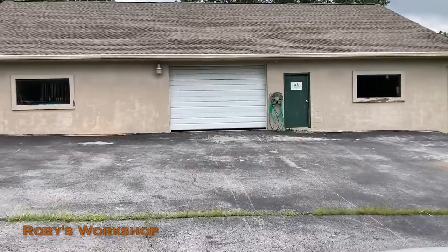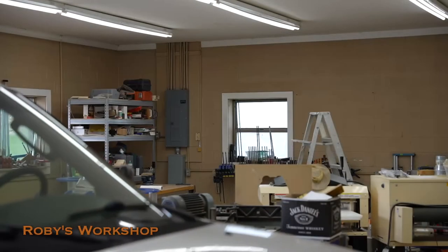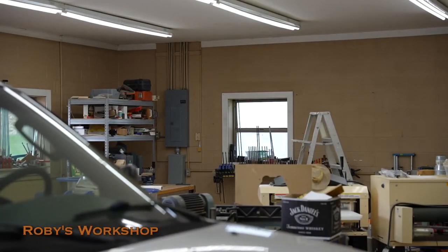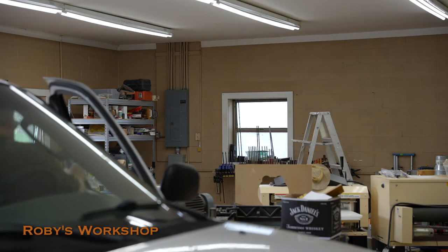I'm Roby Price, and welcome to my workshop. I'm just back from the home center. I've got some plywood, some insulation, a bunch of two-by-fours, and some TAPCONs. We've got to get some insulation up on these walls, and I have to have something that I can mount my dust collection system on. I just don't feel comfortable mounting into cinder blocks with a vibrating unit — I see that as being wrought with folly. So we're going to put up some insulation and some false walls.